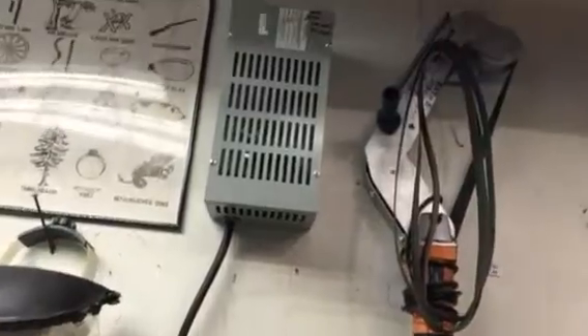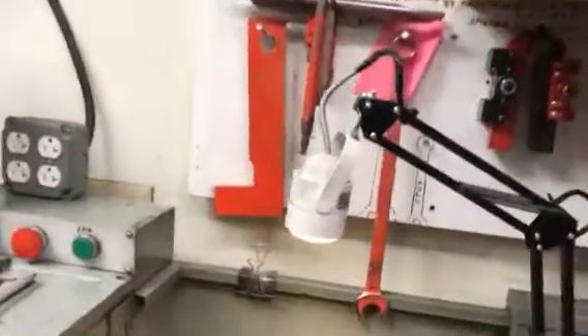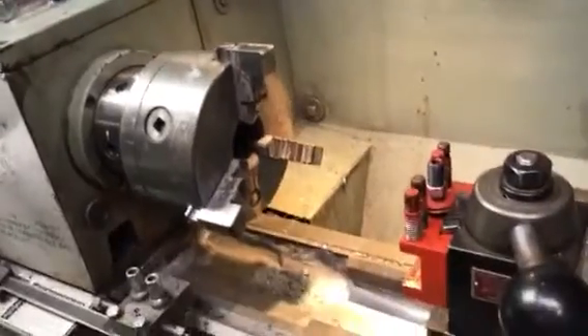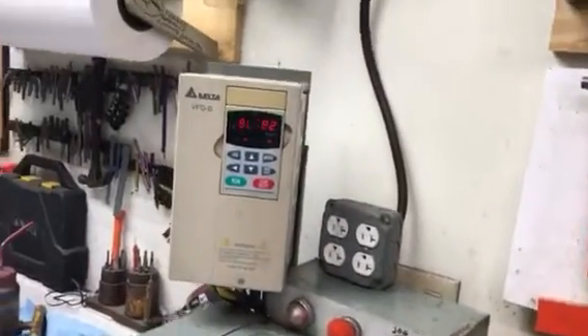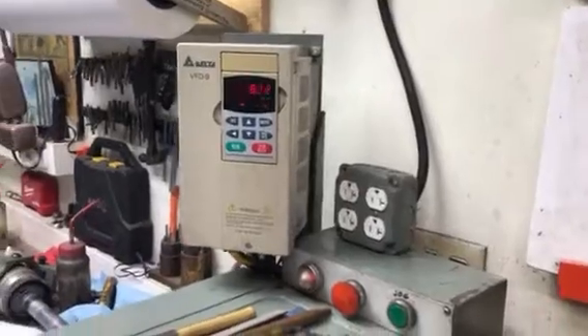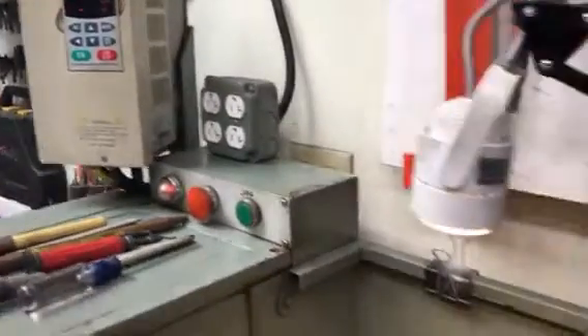This is very well worth doing. I had to set a seven second delay without this external resistor because the internal resistor in the Delta unit is not strong enough to stop this motor.